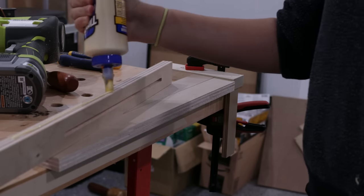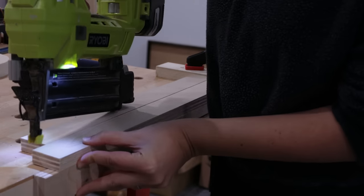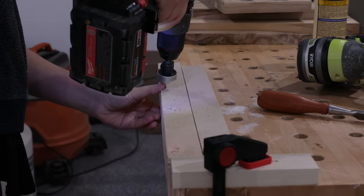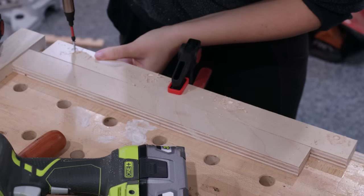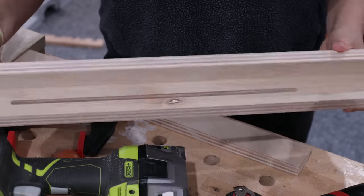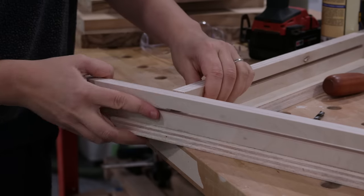The fences can be glued to the bottom of the spacers. I like to set up jigs when gluing multiple parts so it's easy to line everything up — making sure one side is perfectly flush on both pieces and that the edges are flush with each other. I used glue and brads to tack it in temporarily, then came back with some screws to really close those pieces in, since this plywood was a little bit bendy. The bolts will lock into the fences using threaded inserts.